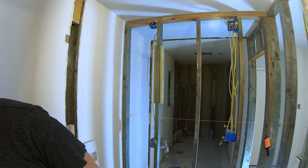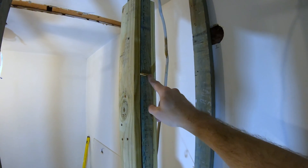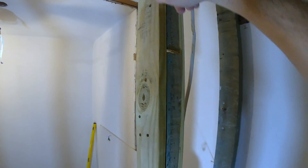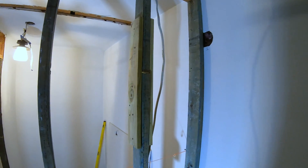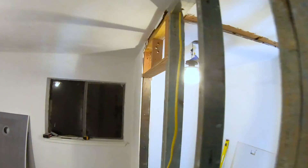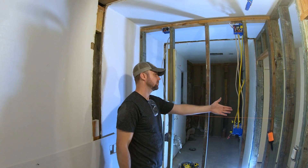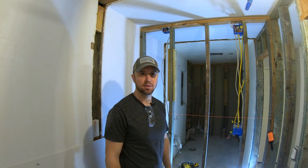So that's basically what you have to do. As you can see, here's where I put the cut, and then I hammered in a shim — basically as I pulled it out, I put the shim in further and further so it would hold it in place. At that point, I basically just take these boards here and screw them in on both sides to help support it, and this is called the flitch plate. That's basically what I had to do — just cut and move that stud a little bit, and that basically flattened out the entire wall and made it so I can actually put the drywall on instead of having those massive gaps. So that is a flitch plate, and that's how you can flatten out your walls so you can put on the drywall without having massive gaps. If you like this content, be sure to like and subscribe, and I'll see you in the next video.